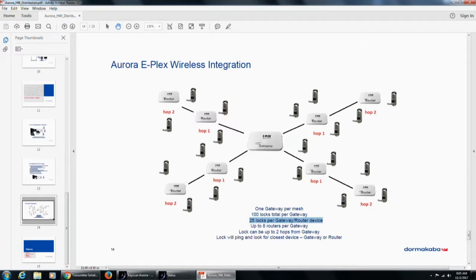Okay. So that's one of the advantages, if you will, of the Eplex integration: it is a panel-less integration. So this is my gateway right here. I'm just going to put this on the network. Done. Cool. With the Allegion integration, because they are a third-party wireless product for basically any access control system, we need to talk to that gateway on our end, which is where the CA150 WLN comes into play. As long as the gateway is on the same network as your other control boards, you can manage it from the same Aurora. So this integration is panel-less, whereas the Allegion will be panel required.